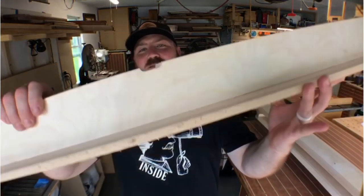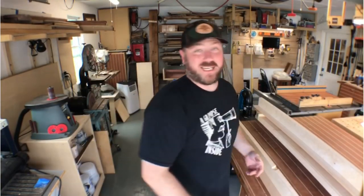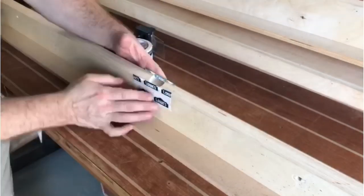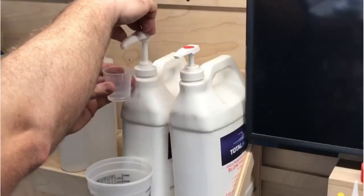Well, yeah, made a mistake — check that out, made a little boo-boo here flattening a slab with my router sled and I gotta fix it. First up in the process is to use some house wrap tape on either side of this mistake, and this is gonna basically form a well in which the epoxy can rest, giving it ample time to dry.